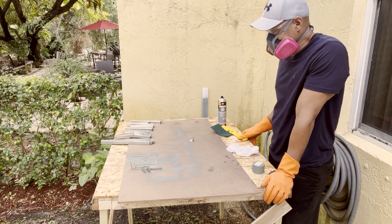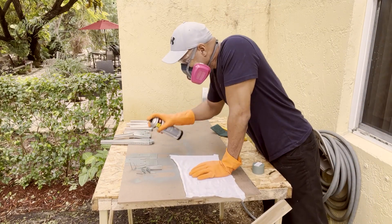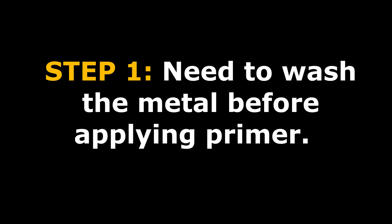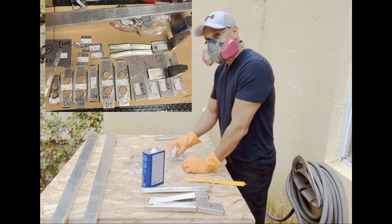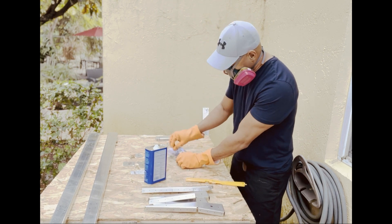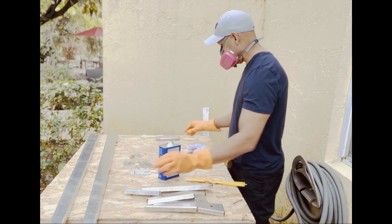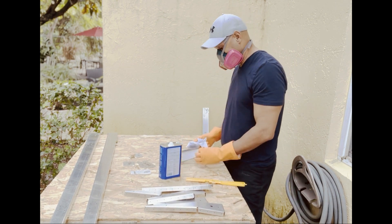There are some important preliminary steps that must be taken prior to applying primer on aviation grade aluminum. The first being that we must thoroughly clean all the metal with acetone. All the parts are tagged with labeling tape, and the sticky residue from those labels must be removed prior to applying the primer. This is not a big deal, but it does take quite a bit of time as every component of the kit is labeled both with marker ink and adhesive paper labels.